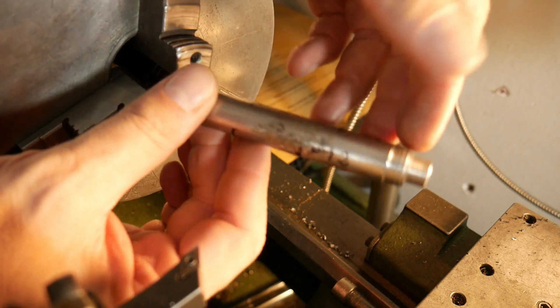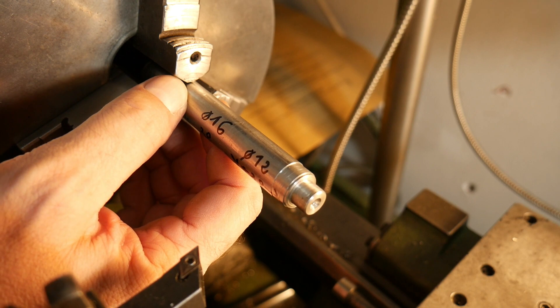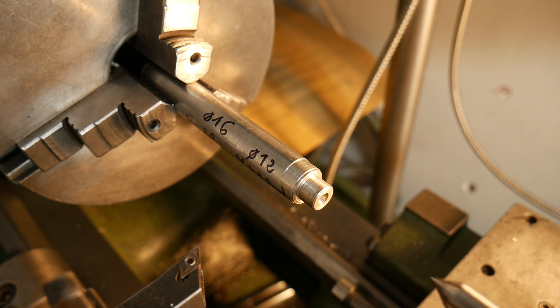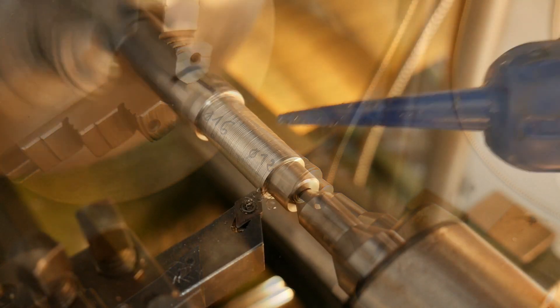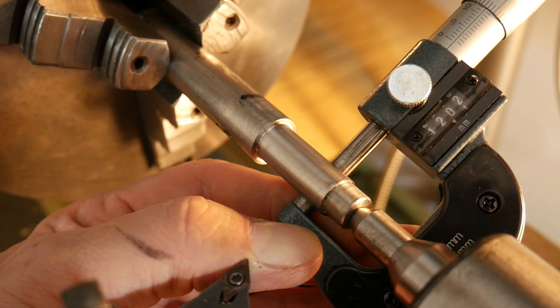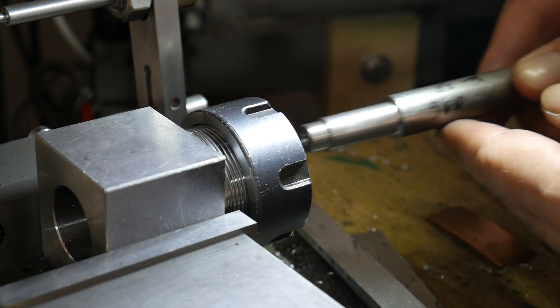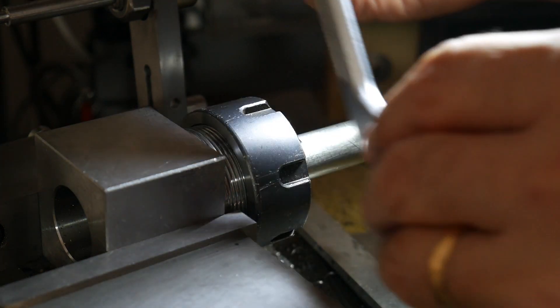I take another round bar and I make the handle with an M8 and M10 screw. To make the tool support I use a round bar of 16mm. The holes in the boring head are 12mm so I turn down the round bar to 12mm. The outer diameter is very accurate and I test it with my micrometer — as you can see it is very accurate.